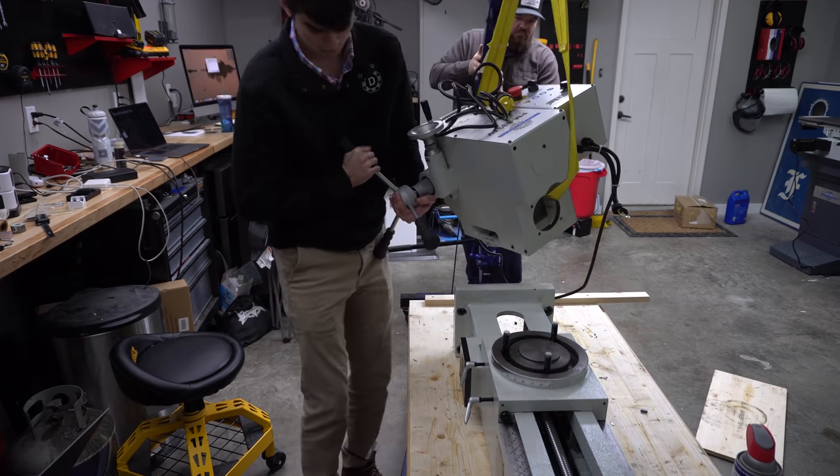However, tasks that are simple to accomplish in other CNC programs, like setting up a pendant, proved to be much harder in LinuxCNC. But so far, the performance of my mill has been worth the extended setup time. A couple other additions that I made were a touchscreen monitor, as well as a tool probe for measuring the height of my end mills.